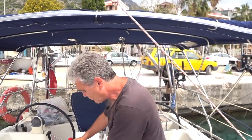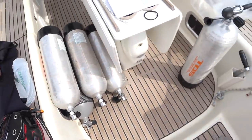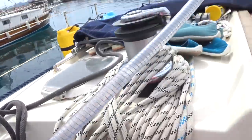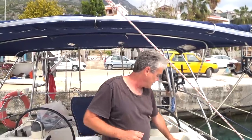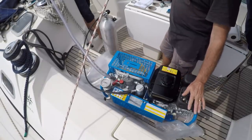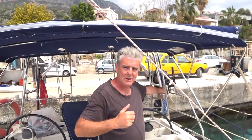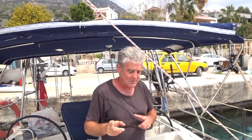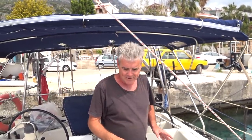So we have our tanks laid down here, first tank attached, and our air intake hose attached to the boom. The exhaust for the compressor is here and the wind is blowing that way, so exhaust fumes go that way and fresh air comes in at this end — very important. We're going to start this beast up now and fill our first tank.